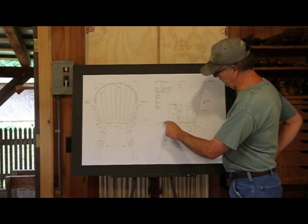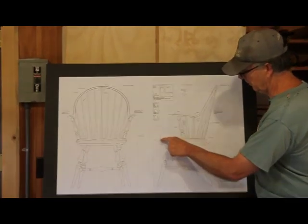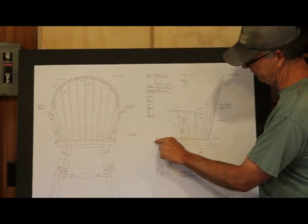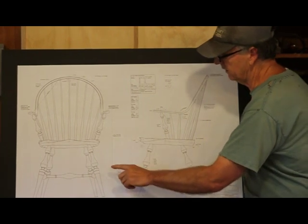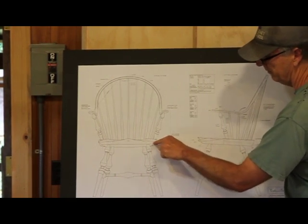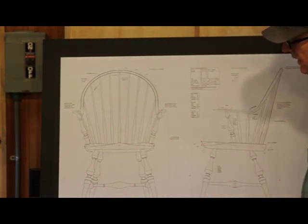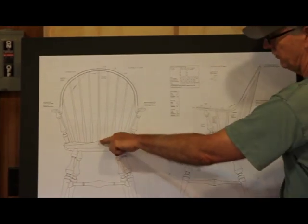We're going to draw the profile that's on the front of the seat. If you look right here, you'll see one and seven-eighths — that's the thickness of the seat overall. Then three-quarters would be measuring from the bottom; I'll put a mark right out here on the corner of the seat. The first thing I'll do is start here at the pommel and draw a line down to that three-quarter mark. I start out by drawing a straight line, then I put a little tick mark underneath it and give a slight curve to it. The reason I do that is to keep me from making that curve too much, so I'm using that straight line as my reference.